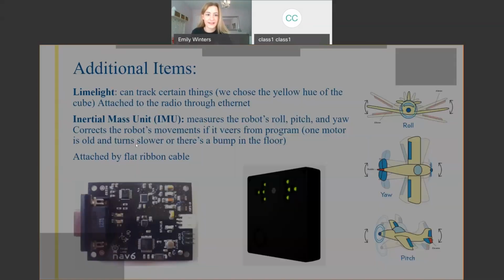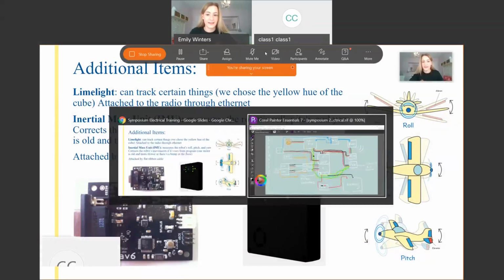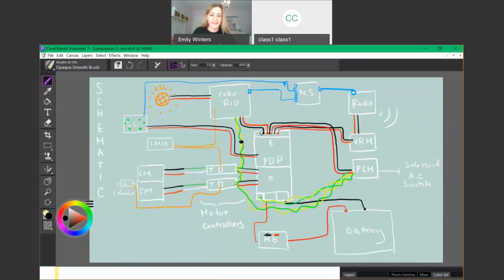Okay, so do we have any major questions on that one? Because we're going into the second part of what we've got. The only question that we still have left open is someone asked, do all of the CAN wires connect? The CAN wires, they all connect. They don't form a full circuit, so it has a start and a stop. So yes, these are intertwined together, and we're going to connect them all with the black clips I showed. I should really draw them all just like that. And I can also share this drawing at the end of the presentation if I'm able to.